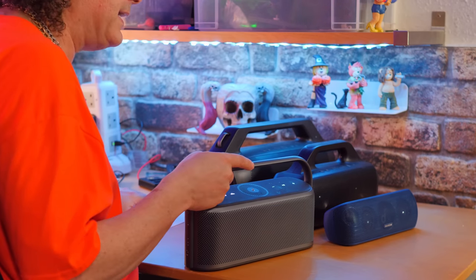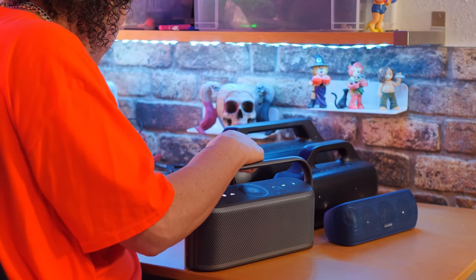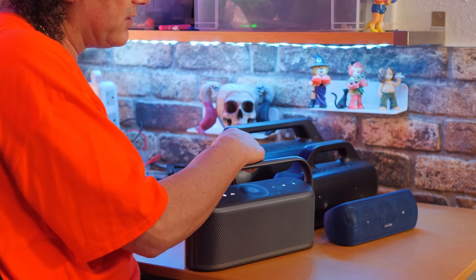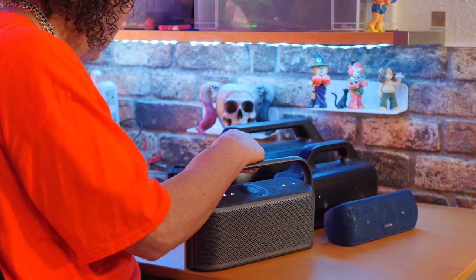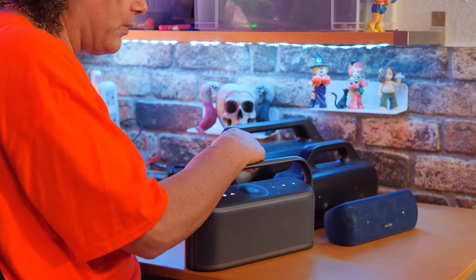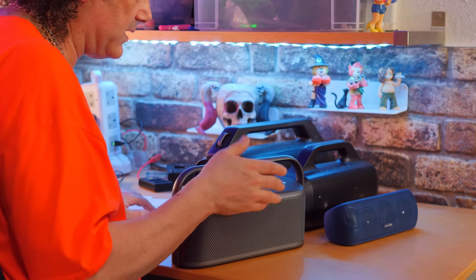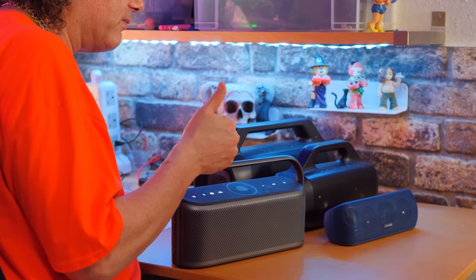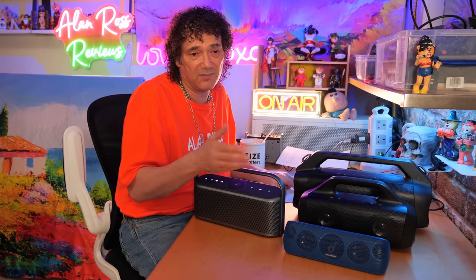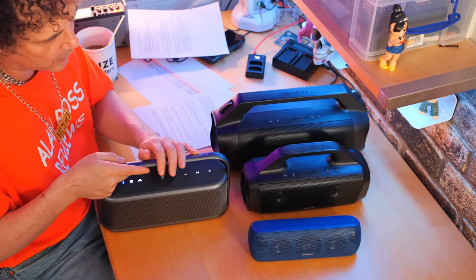The woofer seems to play down to 80 hertz up to with a peak at 350 hertz. But the thing is, the passive radiator appears to be tuned to 60 hertz. There does seem to be a disconnect between the passive radiator tuning, and we've seen this before. To me, it becomes quite obvious there is a disconnect. It's quite high, that 80 hertz drop off, and then 60 hertz, you know, it's low-ish for the passive radiator. So, two modes.